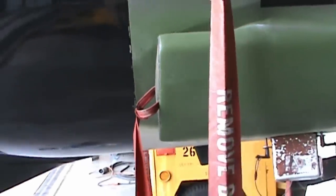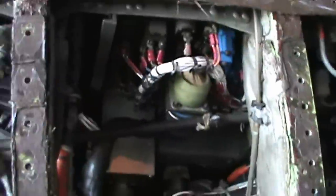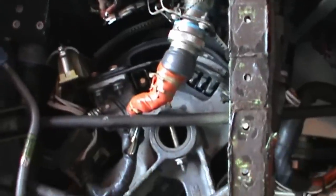Here's the air conditioning intake for the second package on the port side, or left-hand side. Underneath the pilot's console you can see a bell crank assembly for the throttles. Back there are the engine intake splitter plates and the ramp doors for managing airflow during supersonic flight. We'll get up to the cockpit momentarily.